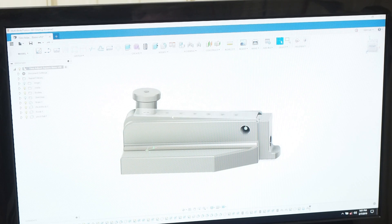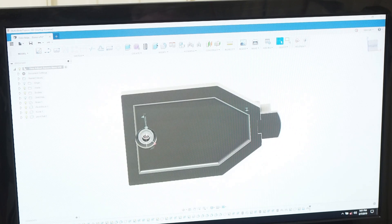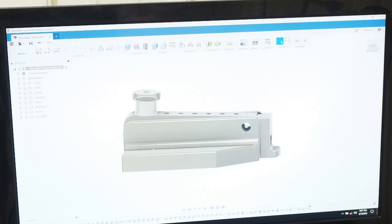I'm going to have a different method of holding the knob base, so these are just quarter-20 tap holes for now - it's going to be slightly different. If you look at the bottom, I need a pivot point because as this goes up at an angle I want this bottom surface to always stay parallel with that surface. If I have my screws sticking straight up without a way for them to pivot, as that surface goes up at an angle it's going to catch at this point over here and ride uneven on that ring, affecting the adjustment. So I want that screw to stay perpendicular to the surface.